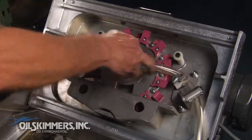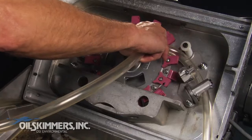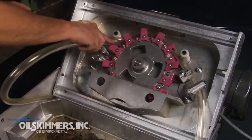Place the tube between the ceramic fingers on the drive wheel, and using a flathead screwdriver, manually turn the drive shaft to rotate the drive wheel. Maneuver the tube between the ceramic fingers, allowing it to clear the white ceramic cylinder guides.